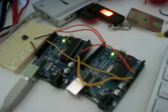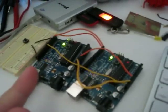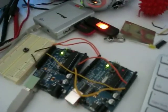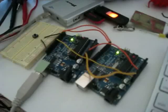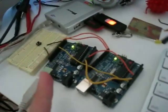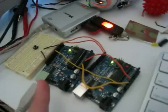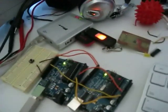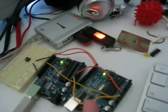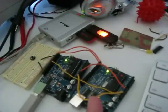It has a copy of the script, and it realized that this one was sending out the synchronization signals, so it picked them up and put itself into slave mode, and there we have the two Arduinos blinking in synchronization, with this Arduino having the BlinkSync sketch that is able to copy over to other Arduinos, but this one having the copied program, which is just the BlinkSync script and cannot copy itself over.